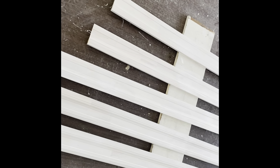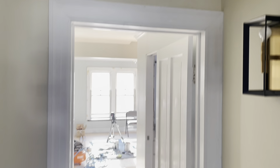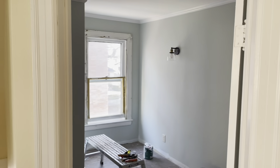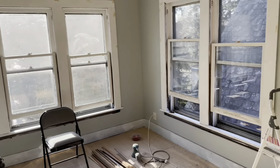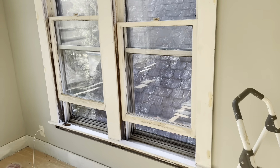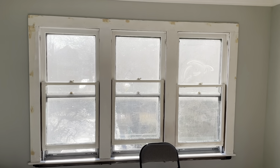We're still talking about the finishing touches: moldings, casings, window trim, door trim. This is brand new stuff that I primed last night so we can install it where we don't have old stuff. We're trying to keep sight lines consistent — in the upstairs hallway everything we've got is old, in the laundry room everything is old, and then we go into the owner suite and everything will be new. These existing windows never had a cool molding; they had sort of planks. So we're going to overlay the cool molding on top, creating a very substantial and super fancy molding to go along with our brand new feature wall.